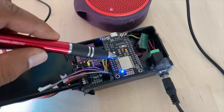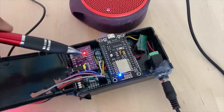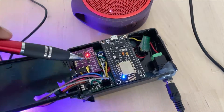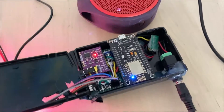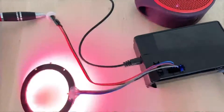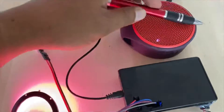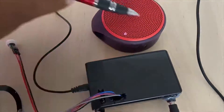The beauty of this setup is that the ESP8266 reads data from SPIFFS — the file system — which gives you around 3 MB of storage. You can store sound files, in our case MP3 files. The idea is that when the motion sensor detects motion, it triggers the lights to create a pattern and plays a random MP3 file from SPIFFS through the speaker.